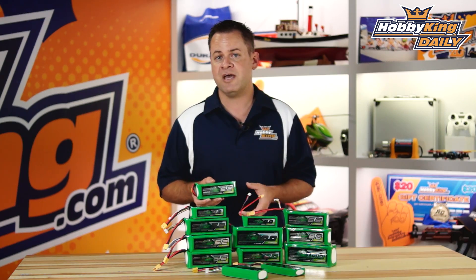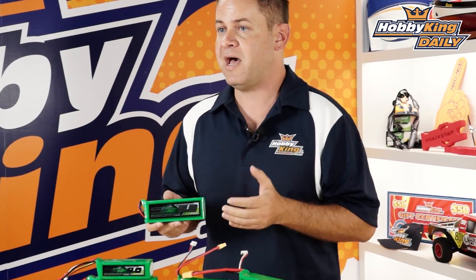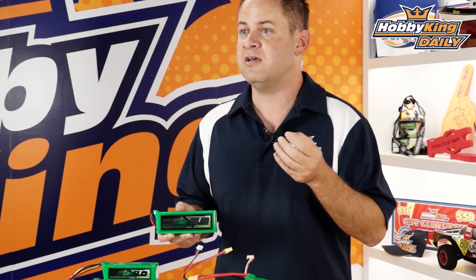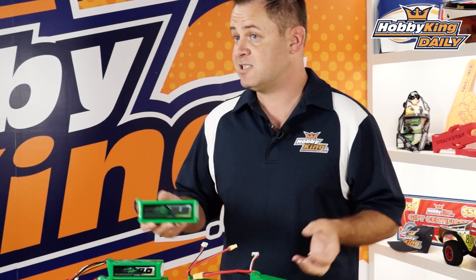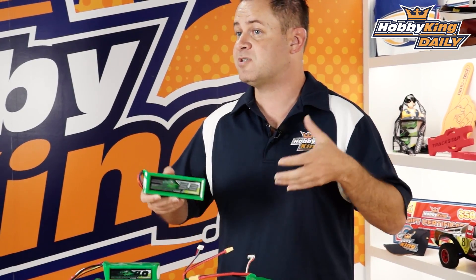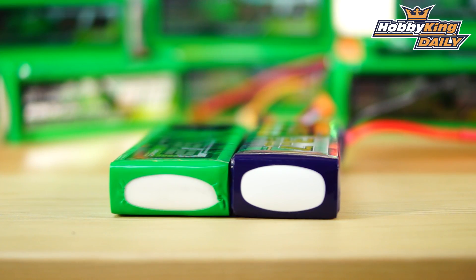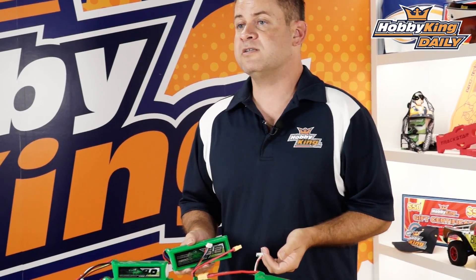The reason for that is that these batteries have much higher capacity for the same given size and weight. The sacrifice is C rating, but as the C rating goes down, the size of the battery goes down. So if we make the battery the same size as the original, that means capacity goes up. And so if we take a battery that is a lower C rating but increase its capacity, then amperage is still able to deliver at a higher rate, which is well within the means of a multi-rotor.